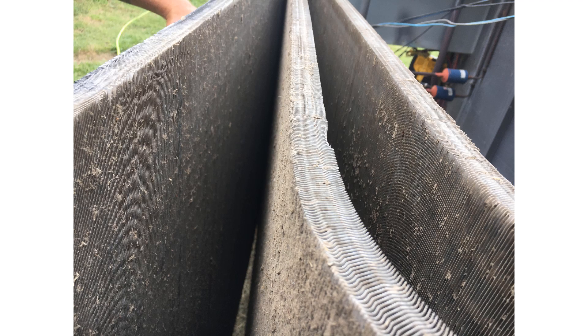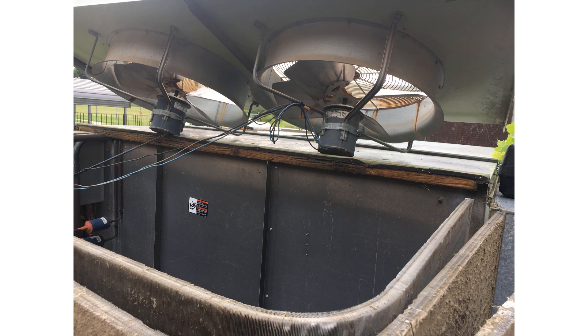It just requires a lot of work. When you need to split a condenser coil, the reason why you would need to do that is because it's a multi-row coil. In this particular case, he's going to show a three-row coil, but even in the case of a two-row coil, you're going to need to split those coils apart in order to get in and clean them properly.